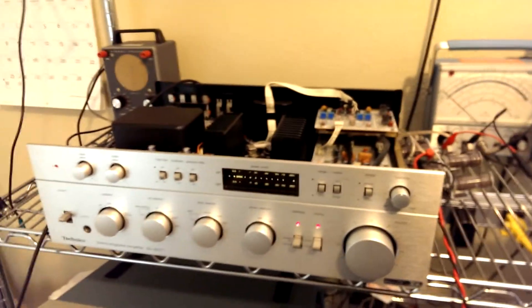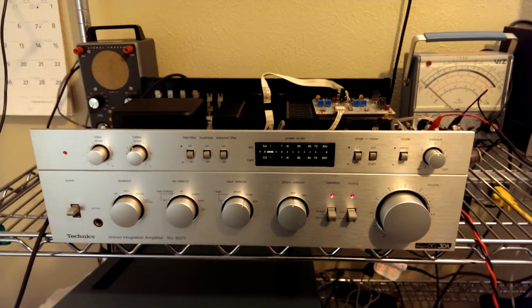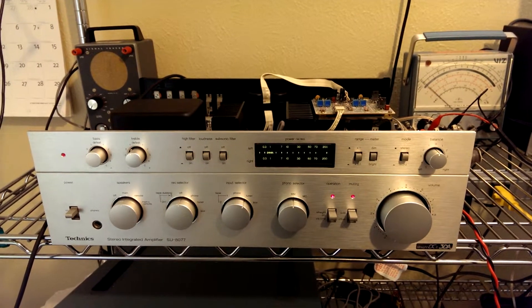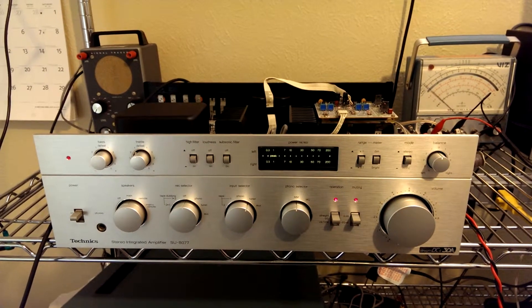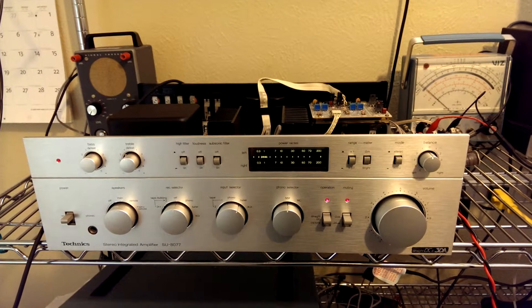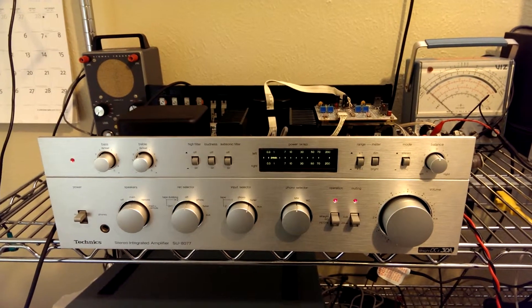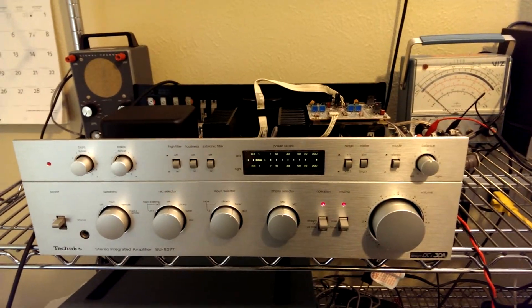Let's take a look at distortion. Unlike some of the earlier amps, these are rated not conservatively, but honestly. As you will see, they will not put out much more than rated power, at least on a continuous basis. They've got a lot of dynamic headroom, but their continuous headroom — there's almost none.